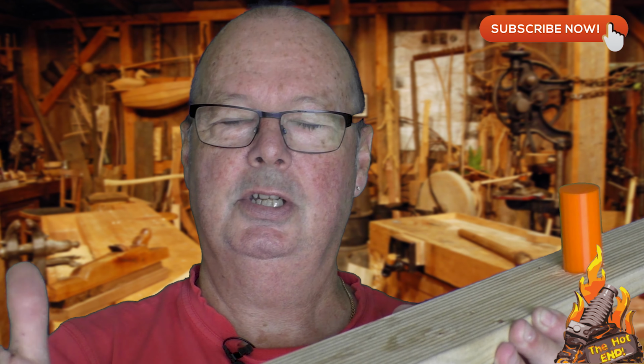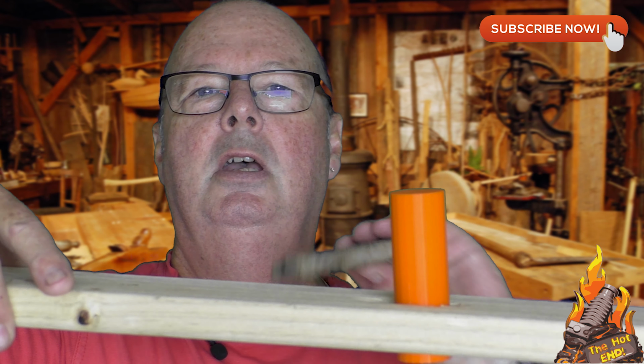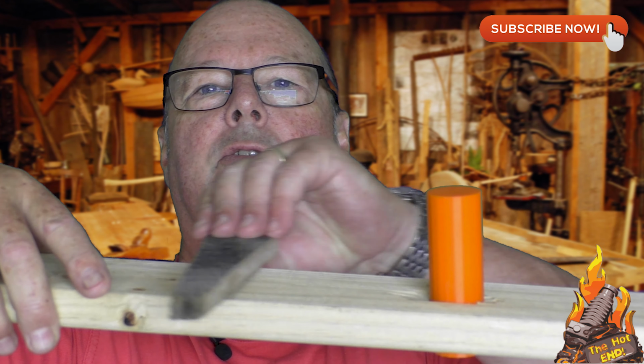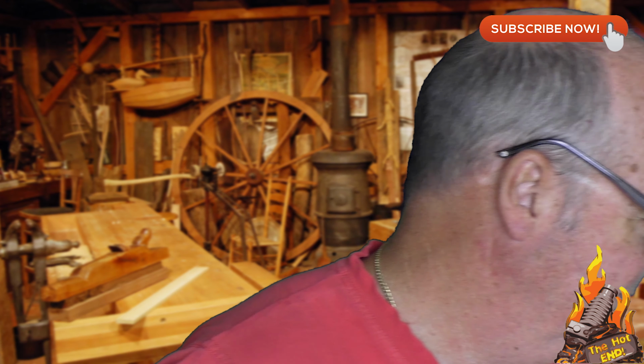And then to squeeze it together, the easiest way is just use a wedge. Okay, so you've got your timber there, you just drive your wedge in, and that squashes your timber this way to hold it all together. Now I'll be doing some videos on how all this works later, which you'll see, but that's how that works.